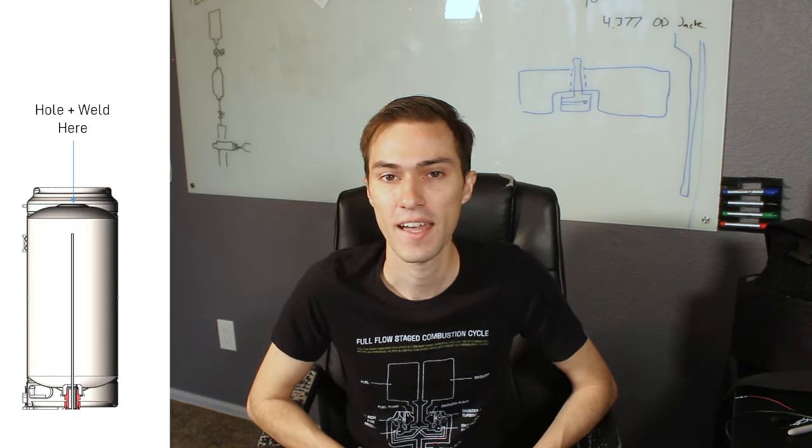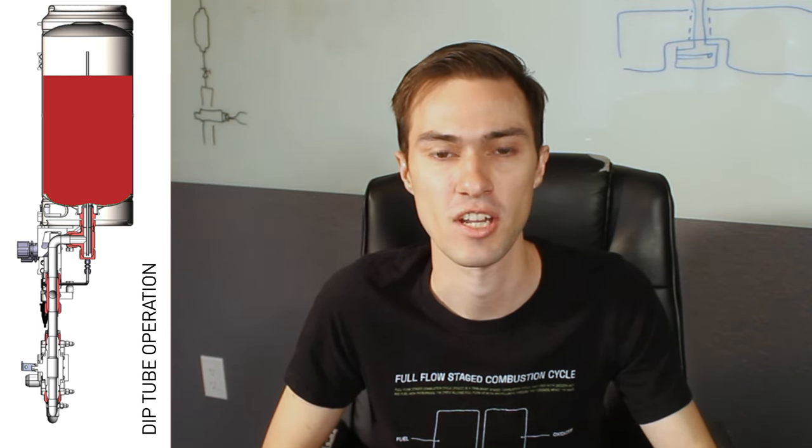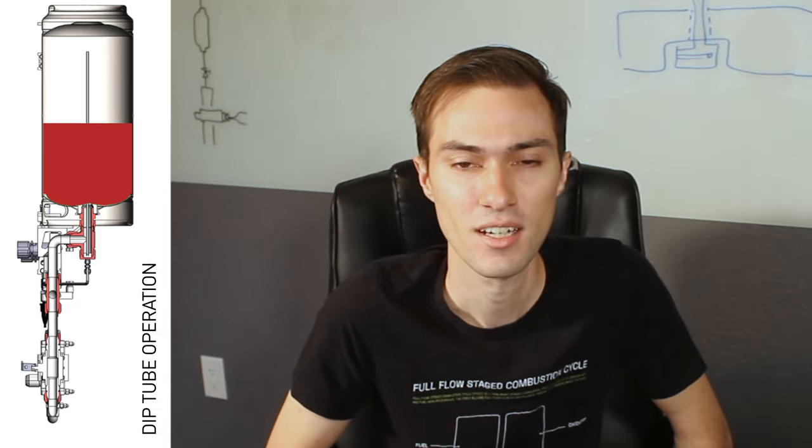As an alternative, I could have drilled a hole in the top of my tank and welded on a dash-10 AN bung in stainless steel, but I didn't want to weld on my tanks — I felt much more comfortable welding on these two fittings where if I damaged them, I could just throw them away and start over. The reason I can't just bubble gas up through the tank is because the gas can actually dissolve in my propellants. Or even worse, for liquid oxygen, because it's so cold, it will make the volume of the gas much smaller because of the ideal gas law, meaning I would need much more gas to pressurize my tanks. While that isn't a particularly bad outcome on the test stand, helium's expensive, but if I eventually want to put this on a rocket, I'd need to carry as little gas as possible to keep the rocket light.